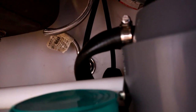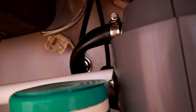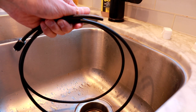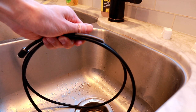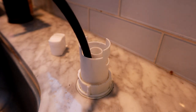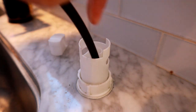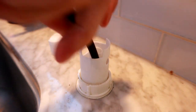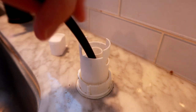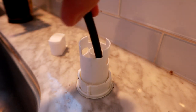As you can see on mine, it has a little kink too, so I'm going to show you how to fix it a little bit better than just the initial quick fix. Go ahead and get some coaxial cable and cut one of the ends off so you can fit it down the hole. Put it down there and kind of agitate it back and forth a little bit. That way you can push out all the food particles and gunk that's stuck and causing the water to back up. Put it all the way down as far as it'll go and then agitate.